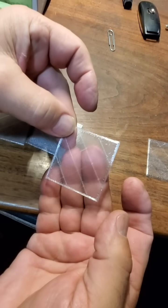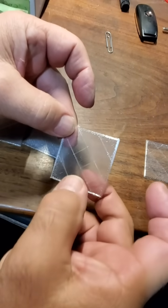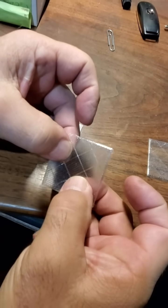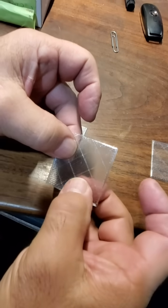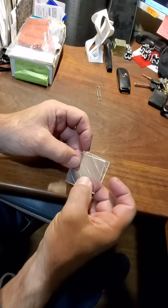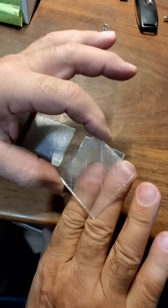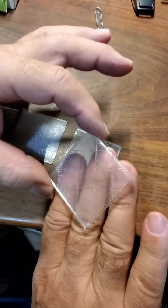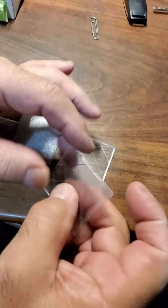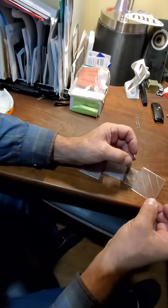Let's play with the settings a little. I took the extruder and upped it from 100% to 140%, and now the individual lines are sticking together — that helped. I also took the temperature from 235 degrees centigrade up to 250 degrees centigrade. So that, along with the extra extrusion and a little bit of infill — that's nice and solid now. Nice and thin, you can still see through it, but it's solid.